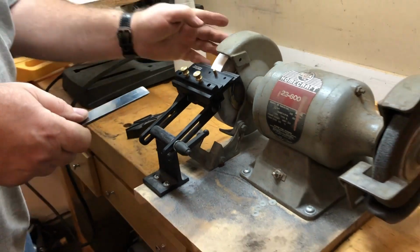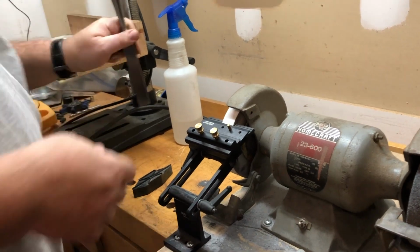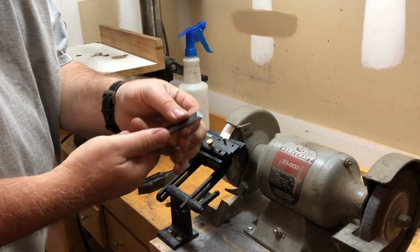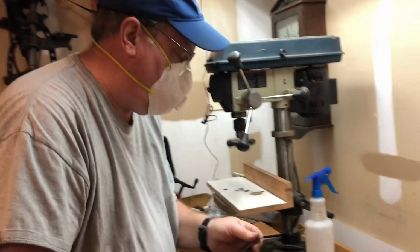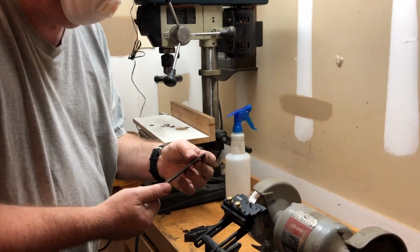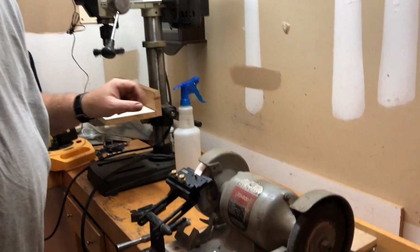And so I have a friable grinding wheel, and to make sure that I don't heat the blade up, I'll be dipping it in water, which I have to get. So next time you see me, you'll see a little cup of water over here. So you just do a couple of passes, you dip in the water, do a few more passes. You don't want to overheat the tip of your tool, because you'll remove the temper in it and it'll get soft. So you got to keep it relatively cool. If you touch it and it doesn't burn you, then you're okay. But it's possible, especially when you get to a really fine edge, to really ruin that edge real quickly. So you got to be careful. Okay, so in the next shot you'll see the water, and I'll be actually starting to grind.